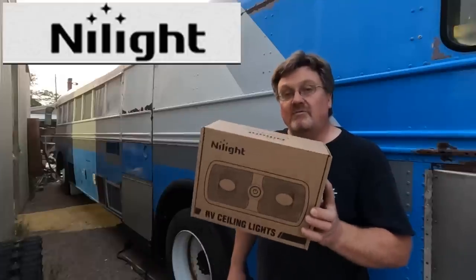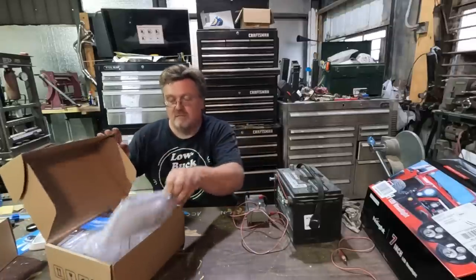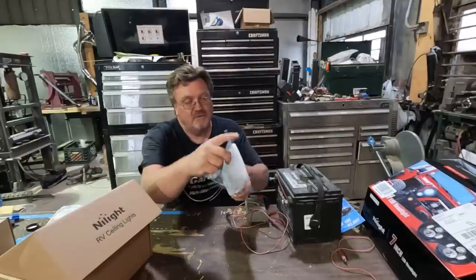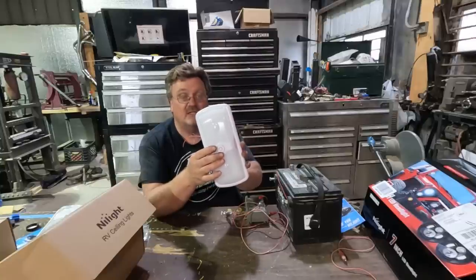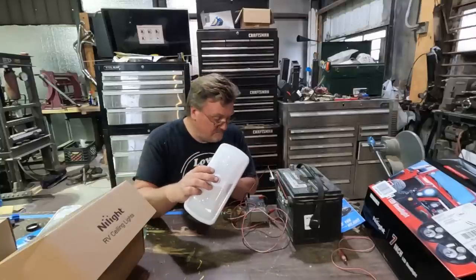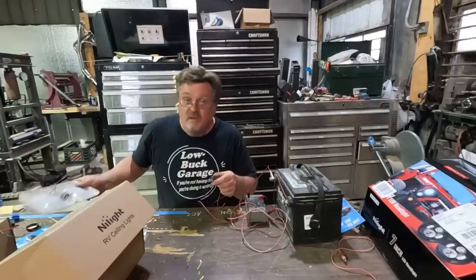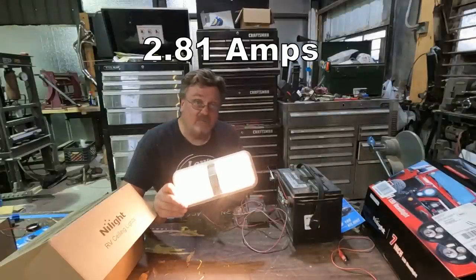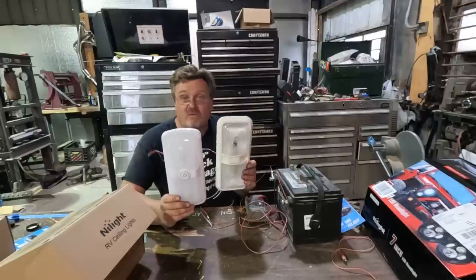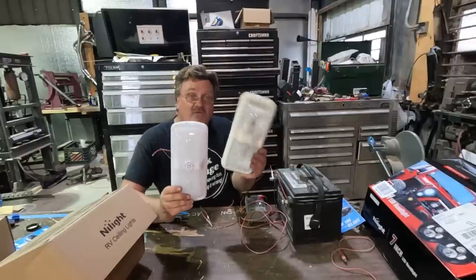Now Nylite has provided me some LED lighting for a few other of my projects. Come to find out, they make RV lights too, and they even sent me some. It's your basic standard RV stuff with an on-off switch in the center, and these should be pretty low-draw LEDs. So let's see how much power they actually take. I'm going to fire them up — we have 0.5 amps. For comparison, I've got an old incandescent style one: I'm getting 2.81 amps. So almost 3 amps on this one. A little over 0.5 amp versus a little under 3 amps — about a 5 times difference.